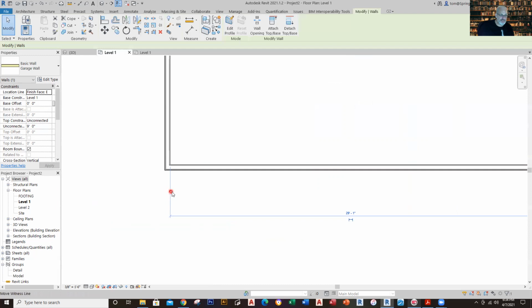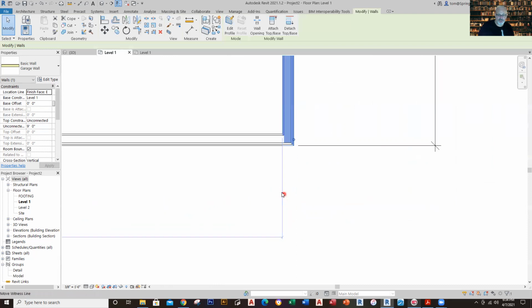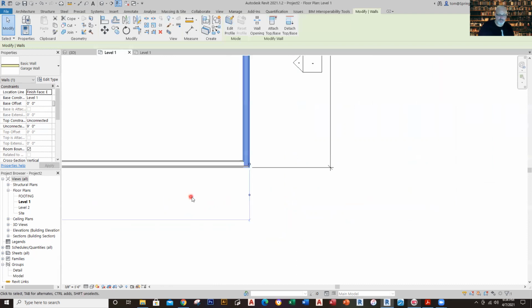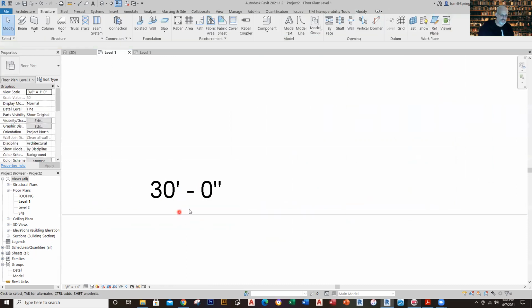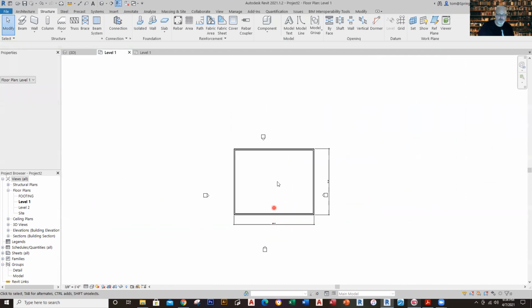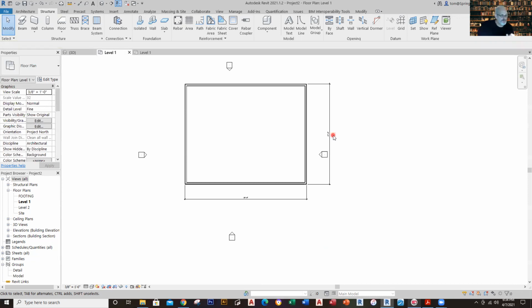I do the same thing for this. I want to go ahead and depict this, so I click here. I move this witness line over to there, and I move this witness line over to here. And if I did it correctly, it should be 30 feet. And is it? Indeed it is. So I click on there and that makes it 30 feet, turns black. I zoom into it, there's 30 feet. So I have my 30 feet by my 24 feet dimension right there. I'm just going to leave those in there. I can move them out later.